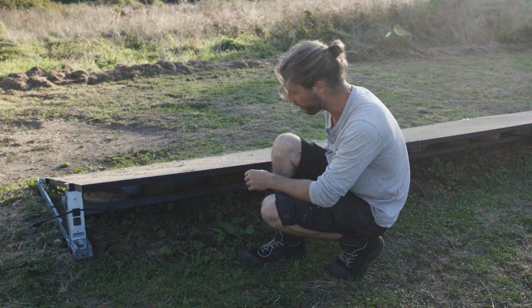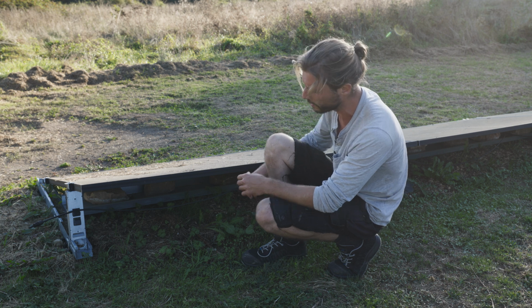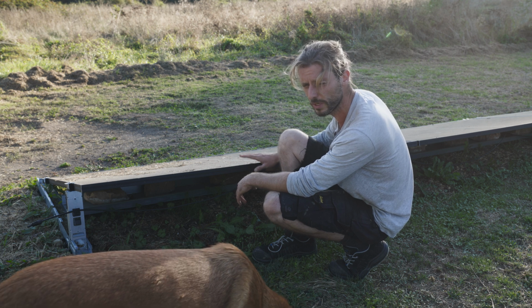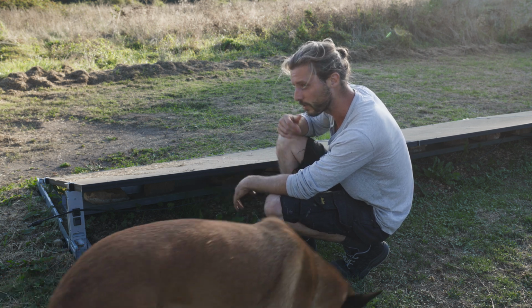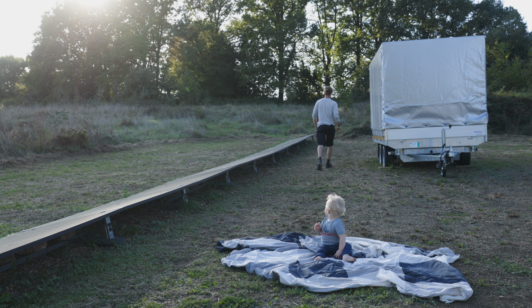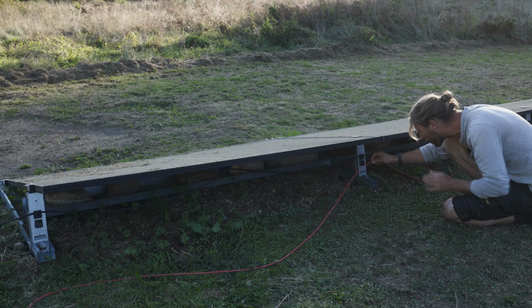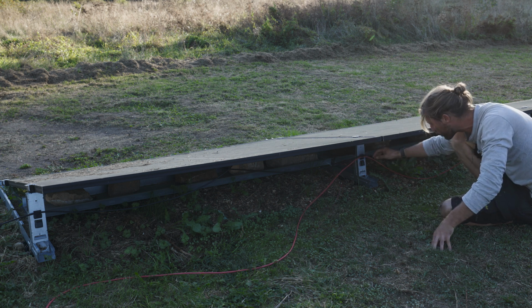Most of the time on the panel itself you will find where the cable exits the panel, if it's the positive or the negative side. So here on top of it, it's the positive side. So I have to bring the red cable here, and then in the middle, because I'm gonna make 2 strings. These are 10 panels, so 2 strings of 5 panels. In the middle one I will bring the negative cable for the first string, make the connection and bring them inside. And then we can clip these cables neatly inside the clips here, so that's easy.